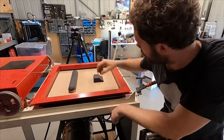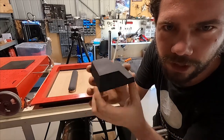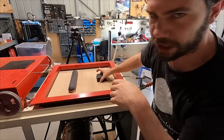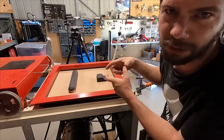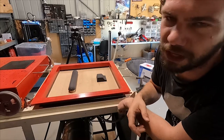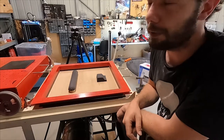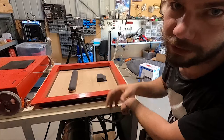We've got our parts on the deck now. I've made up the buck that we're going to form to — it's a nice shape, nice and smooth. I've got another piece to vacuum form at the same time because it seems like a bit of a waste to do just the one little part on the whole sheet. This is for another project — if you want to see how I made the vacuum former or got it working again, have a look at my previous YouTube videos. Other than that, we'll wait for the pump to charge up, put the material in, and suck it down.